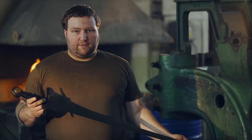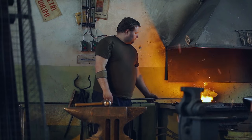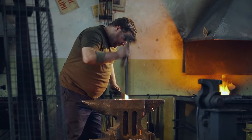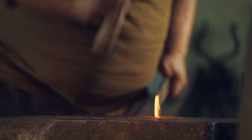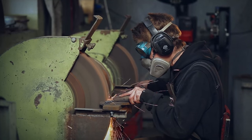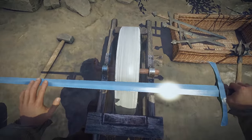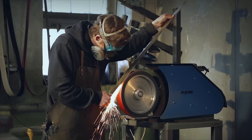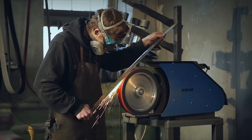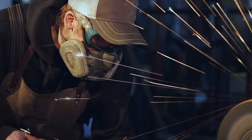I would separate the manufacture into three phases. First, the making of the blade. The blade has to be forged first. After forging and perfect straightening of the material, the blade goes to the tempering shop where it's refined. After tempering comes grinding — the blade has to be roughly ground on a big grinder and then polished on small grinders using various grades of sanding belts. The fuller is also ground out during this process; it's not forged, because the material in the groove must not be compacted and must be more flexible than the edge.